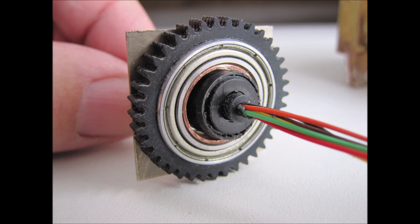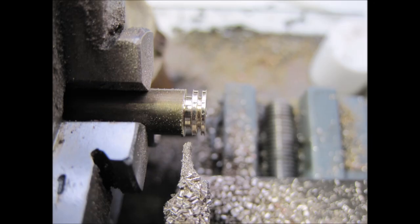If one was building a DCC crane, however, one would need 4 wires running through, 2 for the drive motor feed and two for the power pickups from the wheels. The slip ring was epoxied into the copper tube, making sure it was facing in the useful direction, i.e. that the rotating part was facing down.